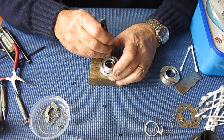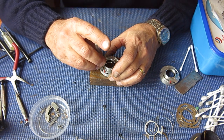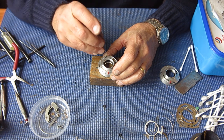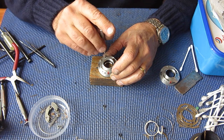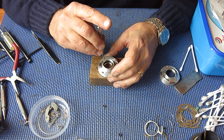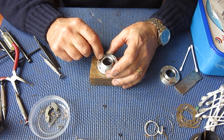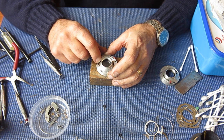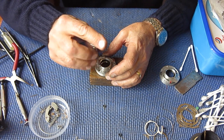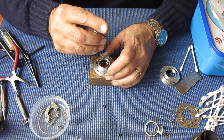What I'm interested in is whether this shutter case makes any difference to that unusual stiff action of the shutter blades. If it does, we can comfortably say that the shutter case was the problem, that it was distorted. If it makes no difference, then something else is the cause, and I would suspect the mechanism plate instead. Anyway, I've got those down, and what do I discover? The shutter blades are still unnaturally stiff. So we can say now that it is almost certainly not distortion in the shutter case, that our problem lies elsewhere.